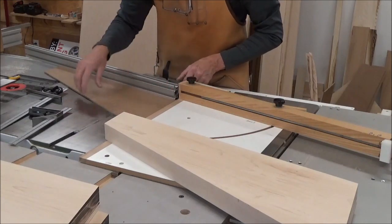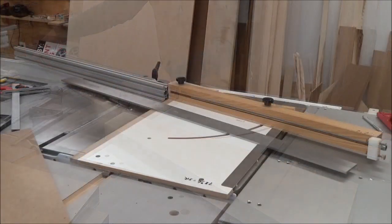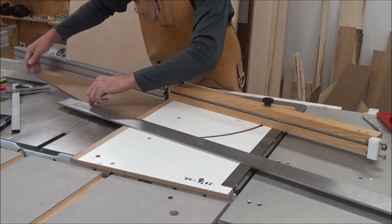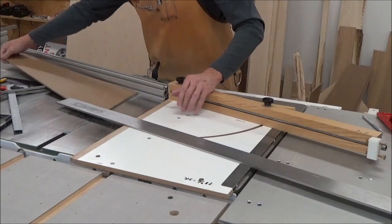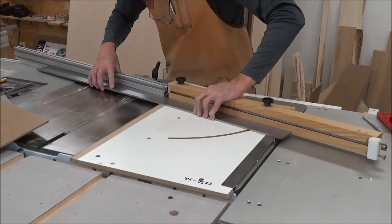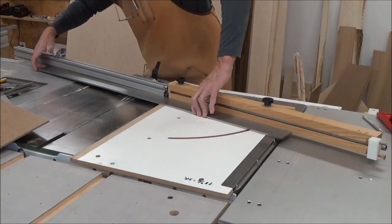I've got a slight gap down here — that slight gap down there turns into an eighth of an inch, so I'm going to get that corrected. I set this angle using this register against my sled, which is a zero cut, and that looks good. And then just as a double-check — which is what I did before to make sure I was in the right ballpark and that they'll be parallel — I match these up. That is good. Nice and tight. I'm happy with that.